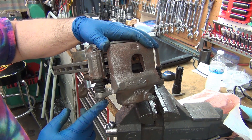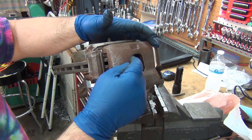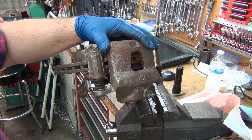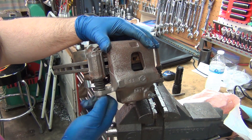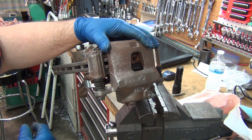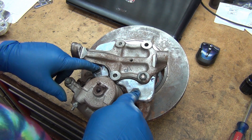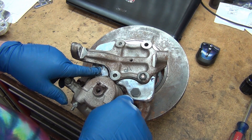This is the bolt that may come into question with the steering arm and the tie rod end. I have thick pads in here — it should be moved up — but that can get ground down a little bit. I may look into getting some different bolts for here, basically those shallow allen heads. I think that might do the trick, and this is actually a kit that gets allen bolts here — partly because it's kind of iffy as to whether or not you can get a socket on there.